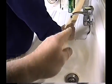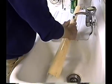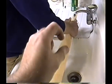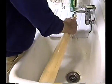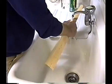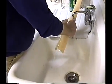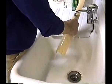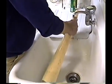Also, what we did is roll the original plug around, make sure we don't have the sheet any bigger than we need it. We want it just to go to the end of the mold and even a little bit shorter. The hotter the water is, and in the worst of all worlds, if you really have some tough wood, you can boil water and just pour it on there. I've done that and let it sit in a bathtub or something, but that'll almost pre-form just with the hot water. It's always better to pre-form it a little bit like that.